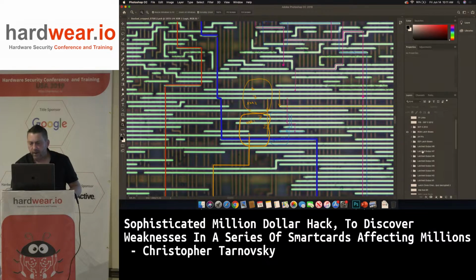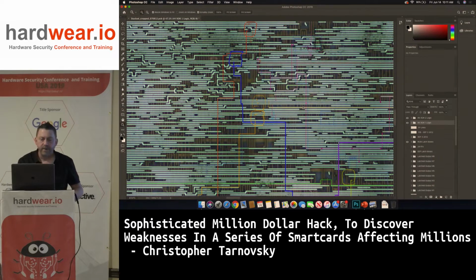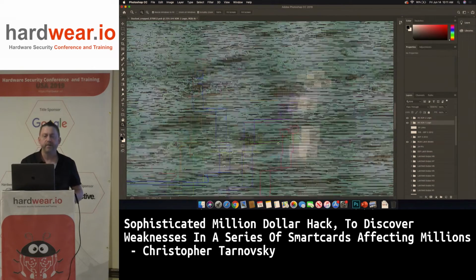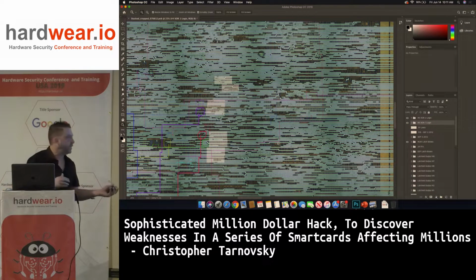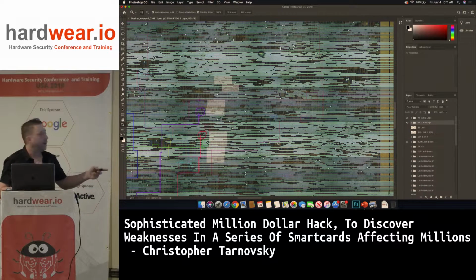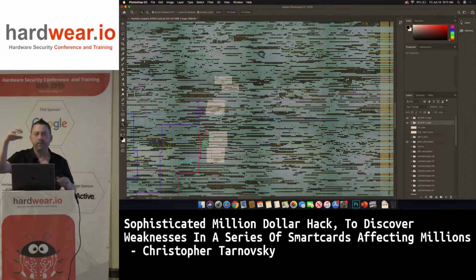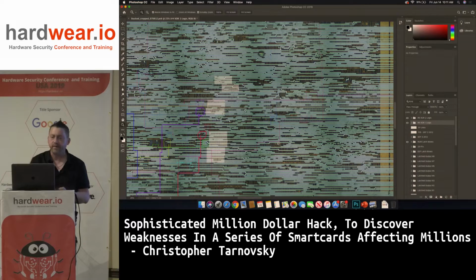So you can see, I have so many comments. So basically, tracing the ROM output brought me here. And you can see here's the instruction registers in the device. So it's game over. The one thing I have to say about ST that I like, the second XOR gate that I showed you, is for bus encryption. So, every peripheral in the chip, EEPROM, ROM, it goes through a scrambler basically. So after every reset, if I'm putting a needle down on the main data bus in their chip, after every reset, it's going to be a different value because of this randomized XOR. It's a random number that they generate on power on reset. And it's very smart. ST's got a lot of good ideas.